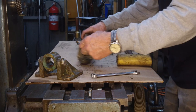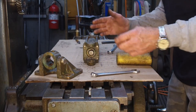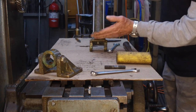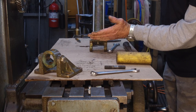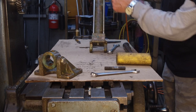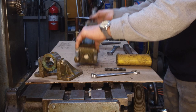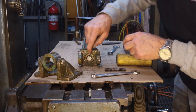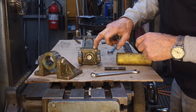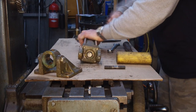Okay, so now what we have is our rod ends, our connecting rods that tighten the bottom half and the top half together and hold the cylinder inside. And there's probably an O-ring underneath here and an O-ring underneath here. And then the rest of it is rod seals. There's a rod seal and wiper assembly here and over here. So this plate right here will probably come off with the rods when I undo the nuts on the top here.